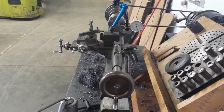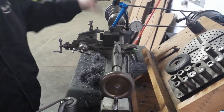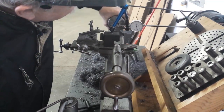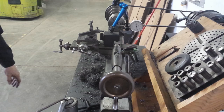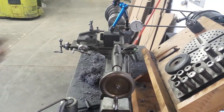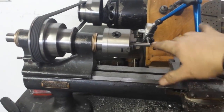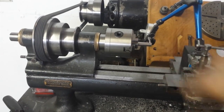I want to show the runout now on the spindle, and actually in the spindle and the chuck. The spindle's really good, the chuck is awesome. It's looking like right around one-thousandth, and it's with a ground rod, about an inch and an eighth or an inch and a quarter from the chuck jaws — really quite good. Three-jawed chucks are kind of notorious for inaccuracies, but there you go. You can see how far off the chuck jaws that is. This is a high-precision ground drill rod.